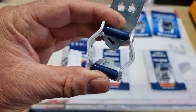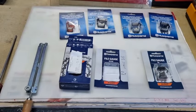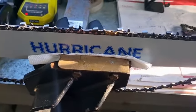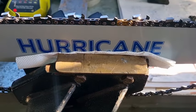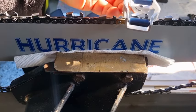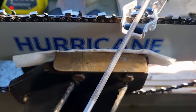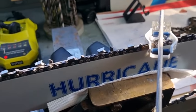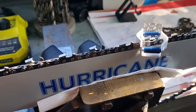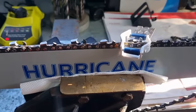When you fit that over your chainsaw bar, make sure those arrows are pointing forwards. We've got one set up here — this is a Husqvarna X-Cut. The two arrows indicate the front, so it's just a matter of sitting the gauge over the top and it fits in really well. You hold your file right in the middle — not tilted one way or the other — hold it right in the middle and proceed to file, and that will file at the right height.